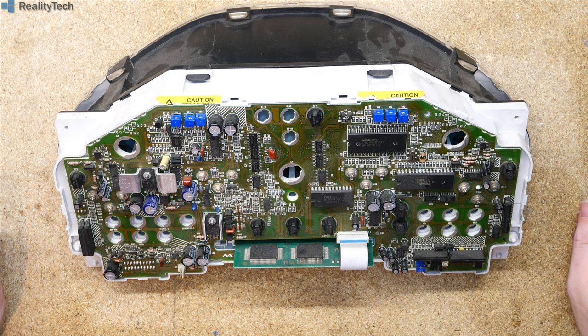Everything on your dashboard is electronic. There's very little that's actually done the old-fashioned way. What is done the old-fashioned way on the dashboard is then passed back to the BECM for it to use. In theory, if you knew what you were looking for and how to do it, you could log all of the parameters of the P38 in much a similar way that modern OBD2 cars do. You'd need to do some work, but it's doable.